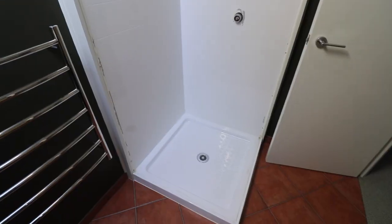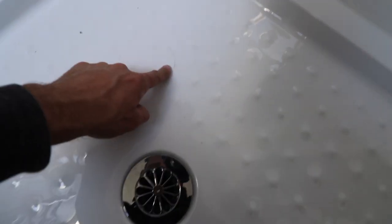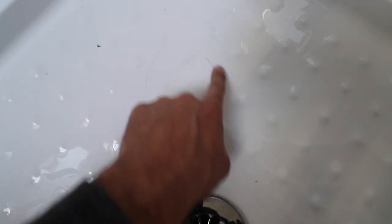I'm not using that polycarbonate today — I'm at my father's house. This shower needs to come out. There's a crack right here. The thing with these plastic shower trays is they go up behind the lining, so to take the tray out you need to take the lining out, and that's what I'm going to do now.